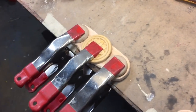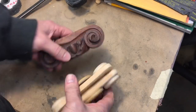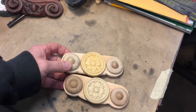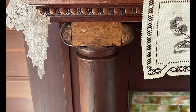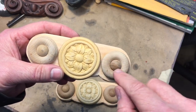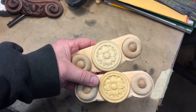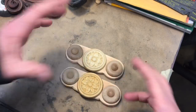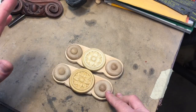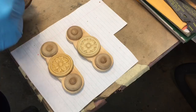Okay, we glued them down. We'll give it about an hour to dry and then we'll try and get some stain on here. Everything's coming good. The glue is dried — here's what we have. This is replacing this on there. The problem we're going to have is getting this to match the color. We need this to match that dark surrounding part of the mantle. Because you have multiple different kinds of woods here, it's all going to absorb stain differently. I think this rosette might have been shellaced — I remember years ago I was going to experiment with something. Either way, it's going to be difficult to get a stain to penetrate evenly. Stain will not penetrate hardwood like it will softwood, so we might have to do a paint — what's called a faux finish. I'm going to stain this first just to show you that it will not stain evenly, but we can always paint over the areas that aren't stained.